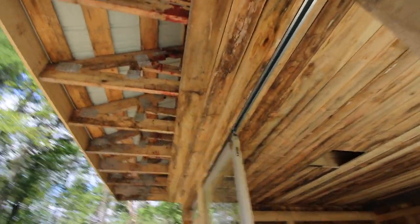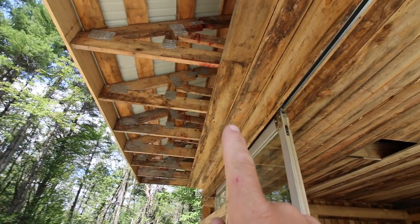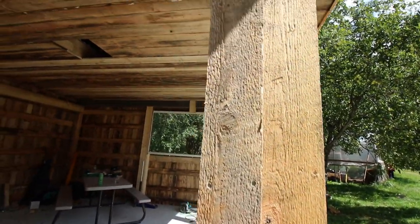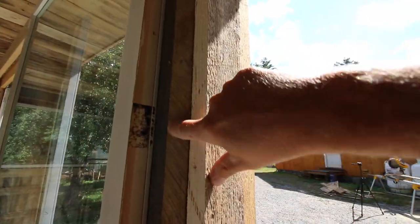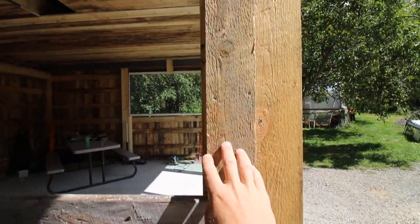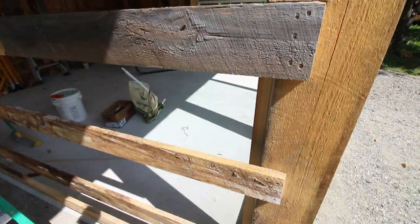It's hard seeing, but I put 2 soffit boards up yesterday for the eave overhang. So now we can start running our boards straight up. I got our filler strip put in and a little bit of a block right here for the window. So we gotta rip our first piece down to 3.5 inches wide, and then we're gonna start with our half wall.